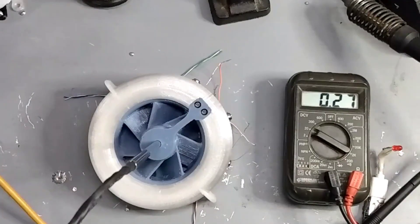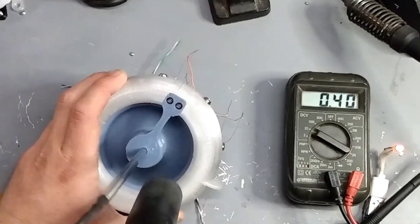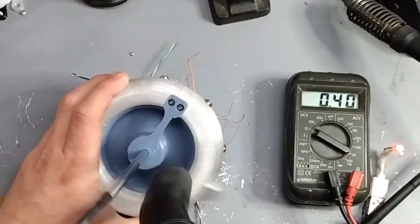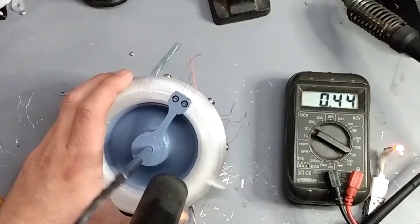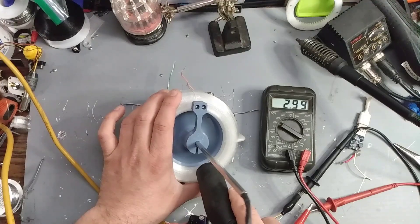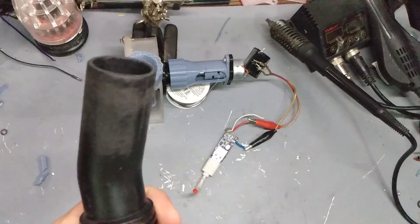After that initial testing, I continued printing out the parts. This time it has the shroud and coil cover on it, which should improve airflow, and I have the two other coils installed for one phase with wires run to the main support shaft as in the final design. I have a USB buck converter hooked up to test voltage. On an open voltage test I get about three volts, which is about one volt per coil, spinning at around 10,000 RPM — a little faster than the intended use case, so I'll need to adjust magnets and coils to get more voltage at lower RPM.